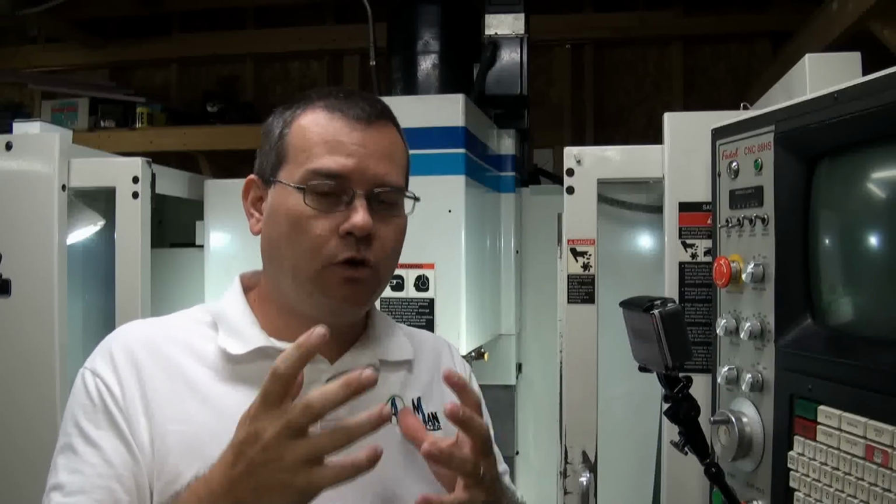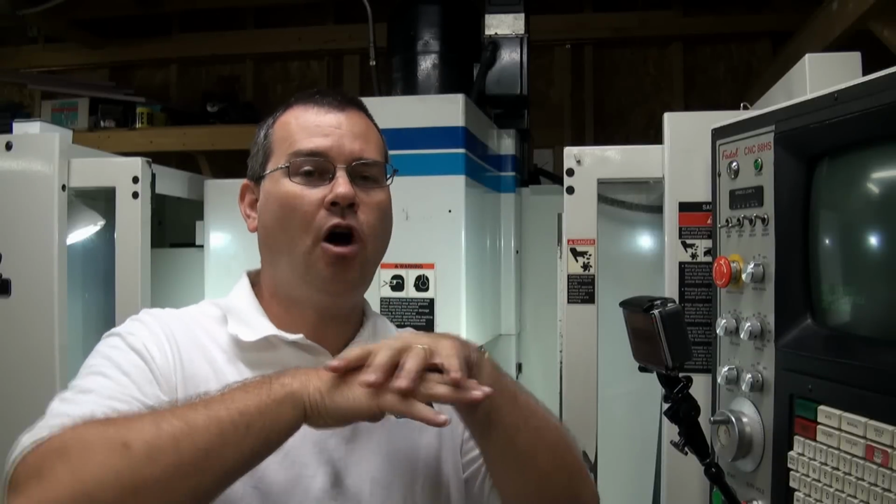The next layer down is something called the tool coordinate system. And the tool coordinate system is a set of offsets that will shift and affect everybody else below it. So if you have tool offsets set, and then you shift your tool coordinate system Z down 1 inch, it's going to shift all of your tool offsets and everything down 1 inch. Okay? If you move X and Y and you have fixture offsets, it's going to shift all of your fixture offsets by whatever you put into X and Y. So it is a master shift of everything else below it, which are your tool offsets and your work offsets, your G54, 55s, etc. Okay?